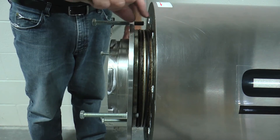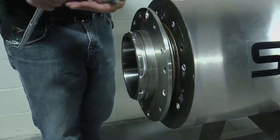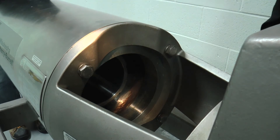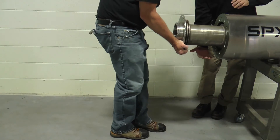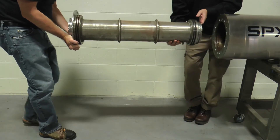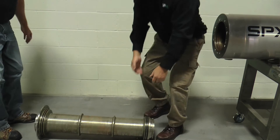Once the jacket side double O-rings are visible, the jack bolts can be removed. Pull the tube out of the jacket assembly from the non-driven end. It is recommended to have another person holding the inside of the product tube from the drive end during the initial removal process and then again upon final tube withdrawal. Also, consider marking the tube and jacket so that the tube can be reinstalled in the same jacket and not inadvertently installed into another votator cylinder assembly.